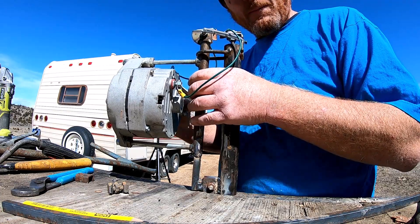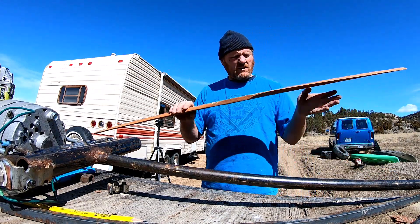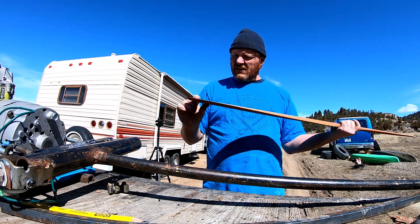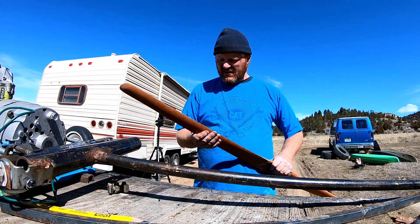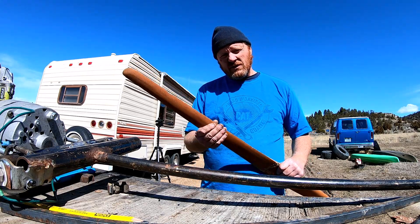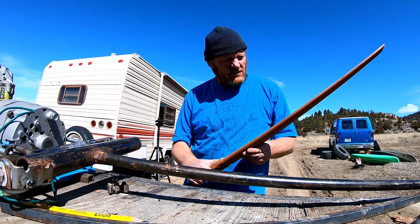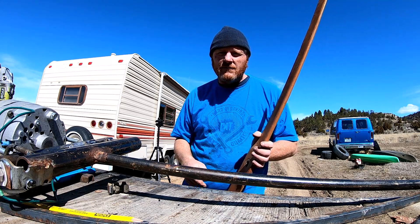Almost no slop — that's gonna work out way better. Now I'm gonna do some work on this blade. I feel like shortening it — I'm gonna shorten it a couple inches on each side, retouch it, maybe put a finish on it again and get it back up in the air. I want a little bit more RPMs out of this thing. I get the charging voltage but it feels like it passes its peak efficiency stage before it starts charging.